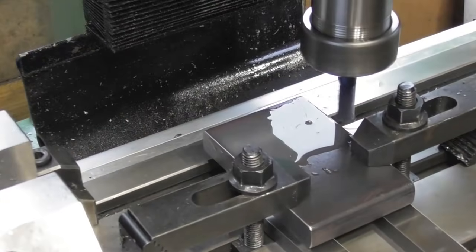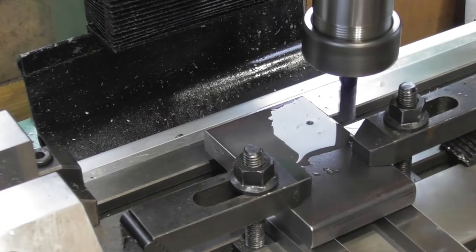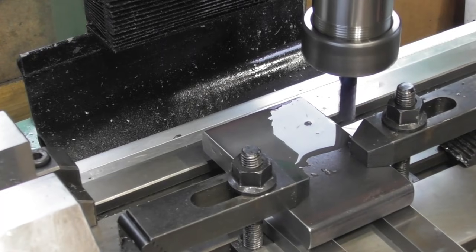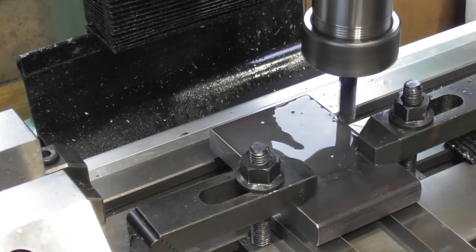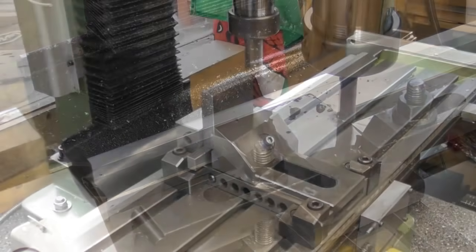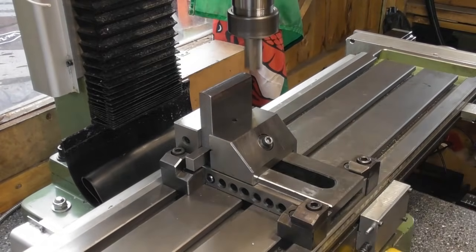So we've chopped the first piece off, deburred it, flipped it 90 degrees, squared it up again, and yeah, 1.5mm cuts. Oop, opposite direction. And we'll chop the other piece off. So with it roughed out, about 63mm square-ish, it's not squared up, it's very much roughed out.